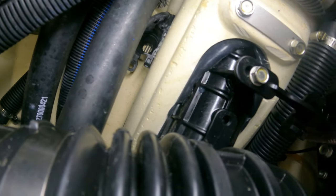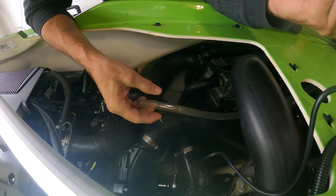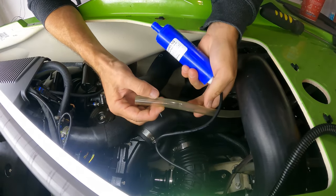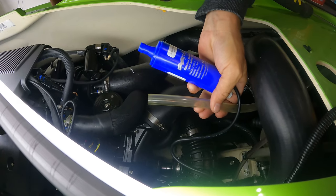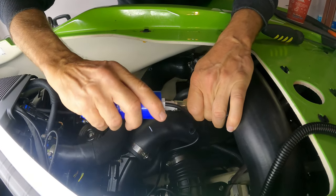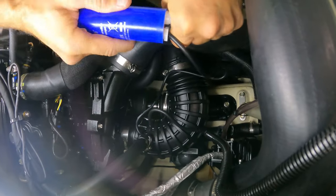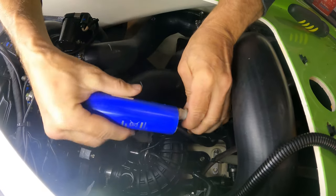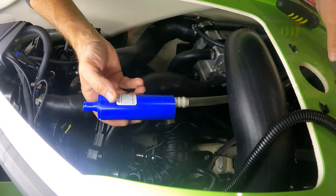Here is the tube we removed — that was the OEM part. Instead we're putting in the bilge pump, and to accommodate it we've got to remove this portion of pipe, so we're just going to cut it with a regular pair of snips. The pipe's been cut. Now gently and slowly insert the tube into the nipple of the bilge pump, make sure it's nice and secure, and then use a tie strap to secure it.